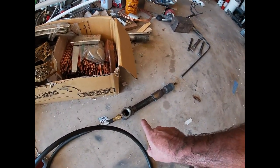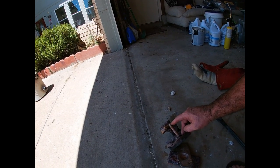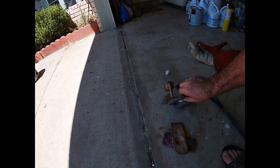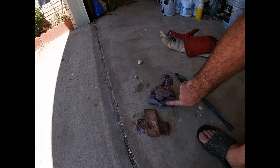I'm very impressed. I had that copper melted before I finished doing my mold — I added more to it so I ended up with 10 pounds. I used a tapered sprue, 8 millimeters at the bottom and 13 at the top. I made a bowl for it going over, came down so the bottom had a gate, the top picked it up and went in here, and then I had a riser — I forgot the name — which acts as a header to put pressure back down. When the metal contracts it's going to pull from there.